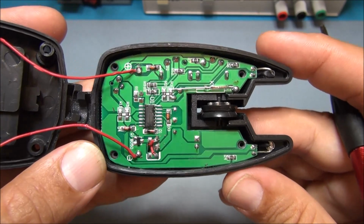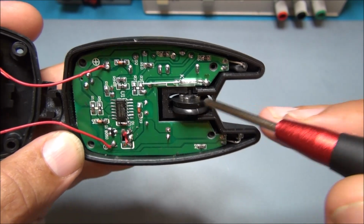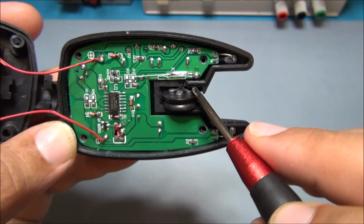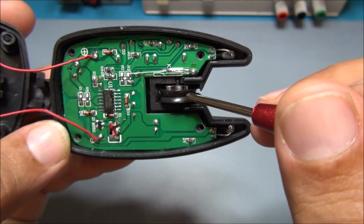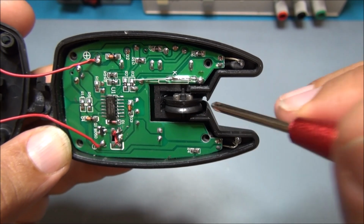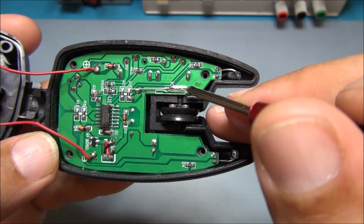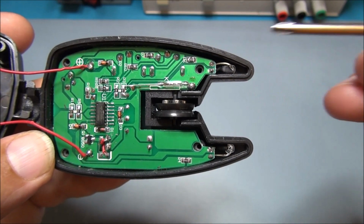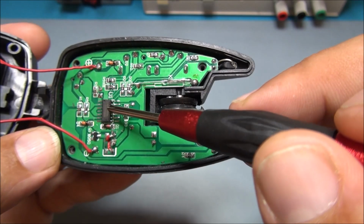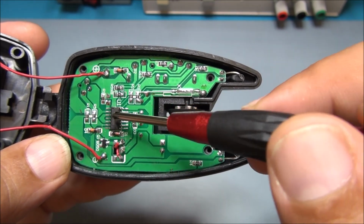As you can see, there is a little PCB inside, and the detection module is not more than a little pulley, as you can see here, with a little magnet inside, and the pulley will turn with the wire when the wire leads this pulley. You will have a magnetic field going through this little reed switch and making some alternating switching, which is interpreted by this little IC, which is a Schmitt trigger, something like that.